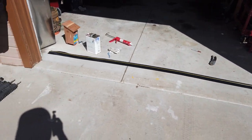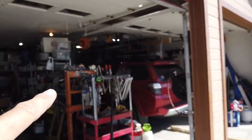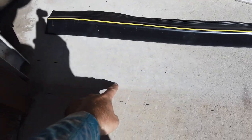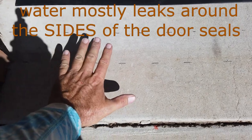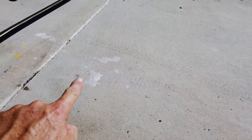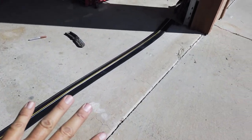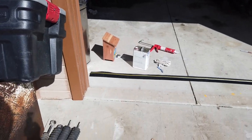The problem is not that the door seals on the bottom of the garage door don't seal. It's that so much water builds up right here because the door lands right here. This space right here slopes into the garage or is basically flat. The actual carport out here, starting here, slopes away. So I have this ridge where water just sits. Even if it's a light rain, water comes flooding in. Snow melt — if snow builds up here and melts in the winter, it ends up in the garage. So we're just going to get these seals in.